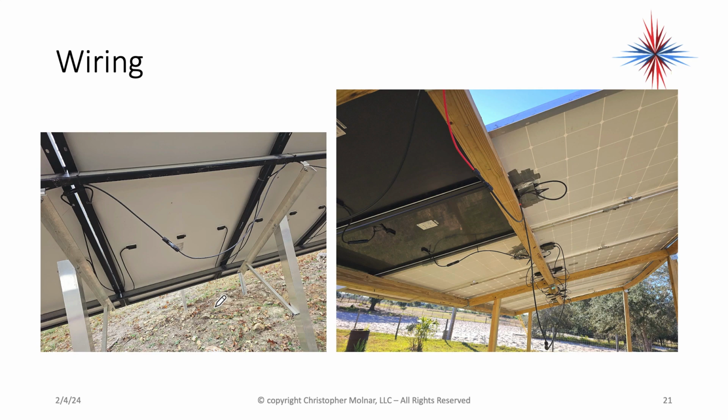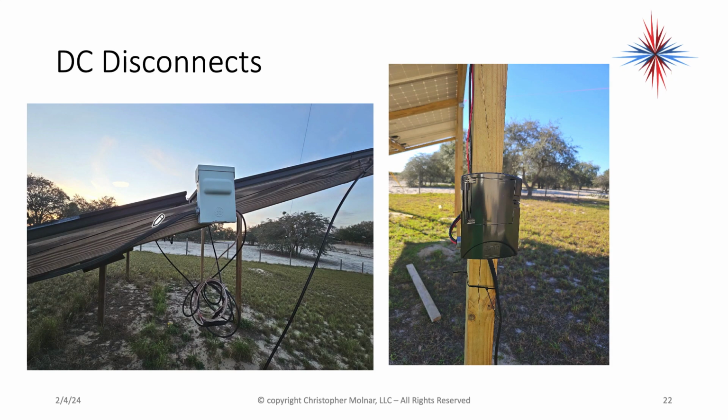Okay, some dangling wire on these panels. There's one connector box here that has fallen off and it has sort of been remounted. There's another one there. Okay, there's a dangling wire here. So some of this is just worth noting. Does it affect operation? No. Could it in the future? Yes. So that's something you'd want to talk to your customer about to resolve.